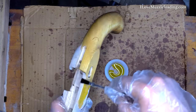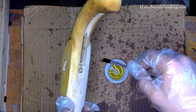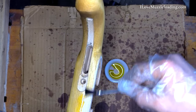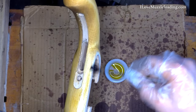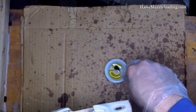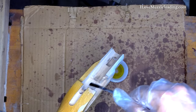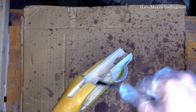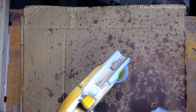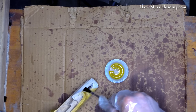Aquafortis goes on one color, and then when you heat it, it chemically changes — it will change in color. On maple, it turns into a rich red-brown depending on the kind of maple that you're using. On walnut, it will turn it black, which looks really cool in my opinion. I wouldn't do it with a curly piece or an ornate piece of walnut, but a plain piece of walnut I think looks really neat with aquafortis.